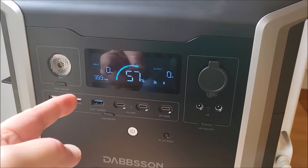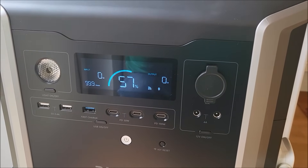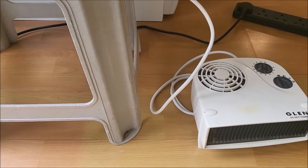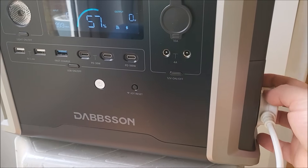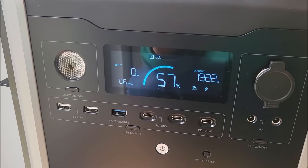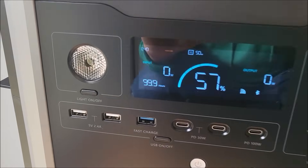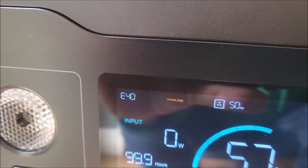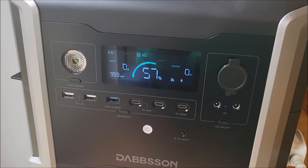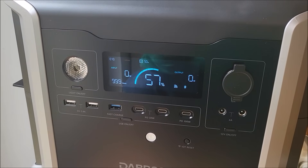The maximum output power from this unit is 1200 watts, but it has a 2400-watt surge capability. When I connect this 2-kilowatt fan heater and switch on the AC output, the output goes up to 1900 watts — that runs for a couple of seconds and then we get E49 overload. But that 2400-watt surge capability means you can use all sorts of compressor-based devices or devices with high surge currents — it's double the power for a very brief time.